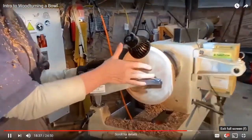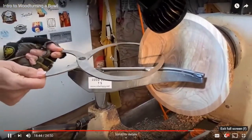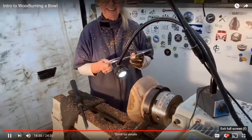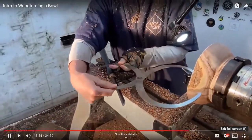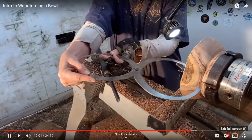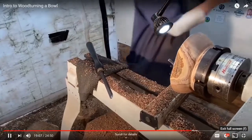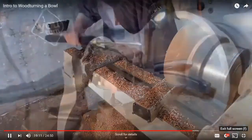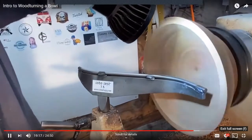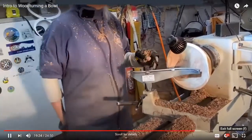There's still a little lump right there. I'm going to use calipers to see if my wall thickness is the same all the way around. I start here and just slide it around — if the distance stays the same then I'm good. It gets a little thick at the back, so I'll thin that out some more. I want it ultimately to be about that diameter. All right, this is feeling great.